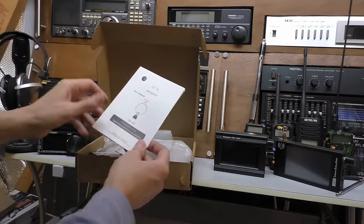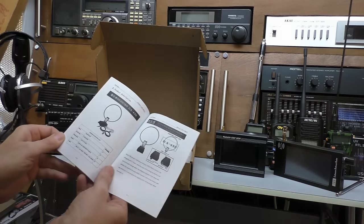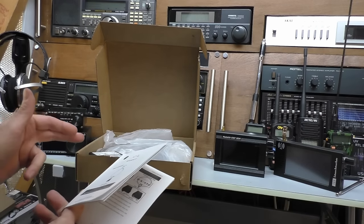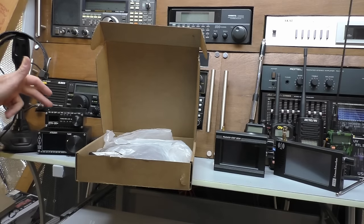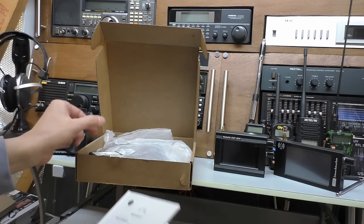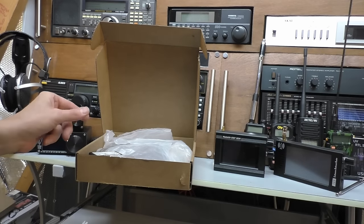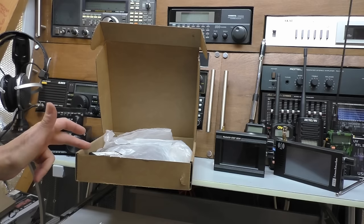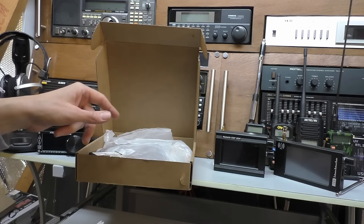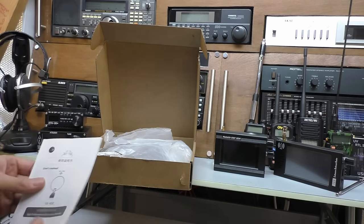First off there are some instructions — it's very easy to use, pretty simple, there is some English at the back. Now this does claim to be an active tunable antenna. When I tried it with this little ATS20 Plus, it was only a short test. I found that turning up the control knob, to me it just felt like a gain control, but it does say it's tunable. We'll test that in a moment on one of these little SDRs — we'll see when we tune that knob does the gain go up and down or is it consistent.